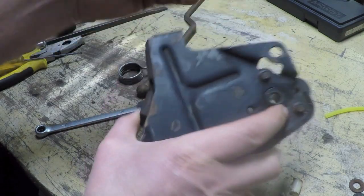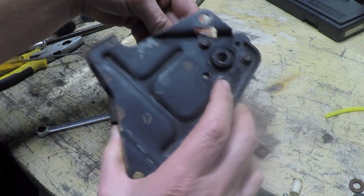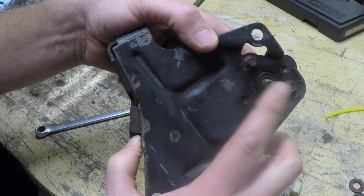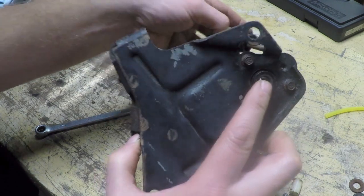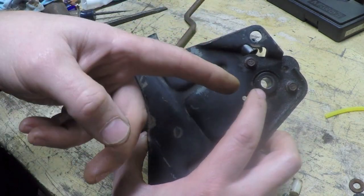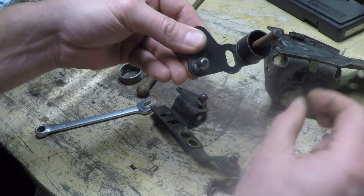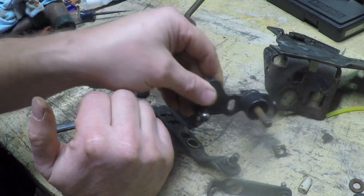We've got a groove here and a shaft — we need a fastener that's going to be able to go in there. A regular E-clip might work, and I might just have to worry about whether it would stay put. I was searching around and found on McMaster-Carr something called a shaft end clip. Lo and behold, it's a clip that looks just like this. I just have to find out what the dimensions are and see if I can find one with that dimension.